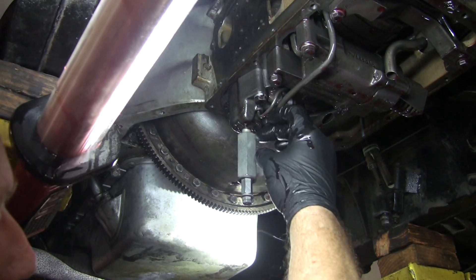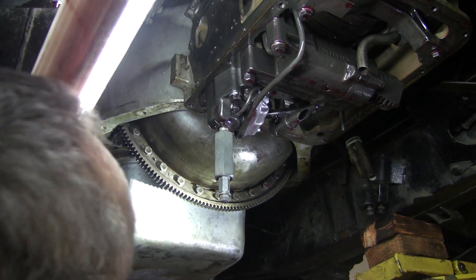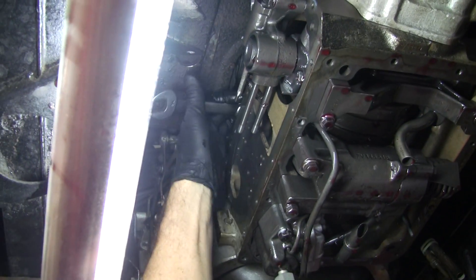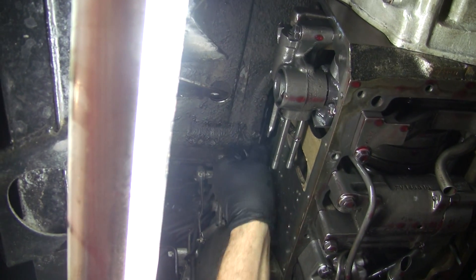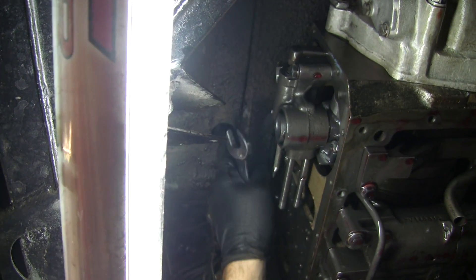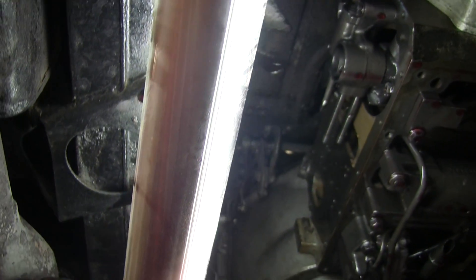What this does is there's a spring inside here attached to this shaft. This thing should just barely turn. As you can see it's really loose, so that means the band needs to be loosened — so that's a three-quarter on top. When you don't have the valve body and the side cover off, this is difficult from underneath because it comes out to about here and you can't see it. There's an access plate on the floorboard, and here's where the rubber plug normally is to get to that throttle linkage. So this band is too tight? Yes, it's too tight, correct.